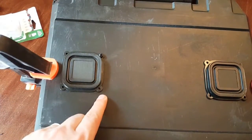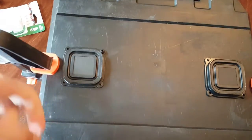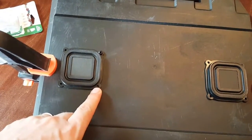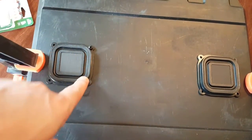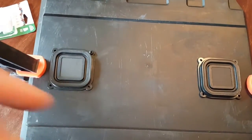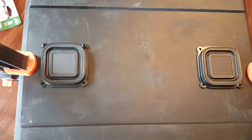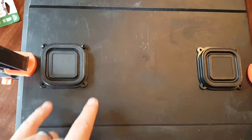One thing I want to remind you: when doing this, don't push down really hard on the drill. If you push down hard, as soon as you go through that layer of MDF — which is only a quarter inch thick — your drill is going to go right on down and you're going to damage the speaker. So just go very gently and slowly until you're through. Once I finish with all eight of these, I'll show you what that looks like.